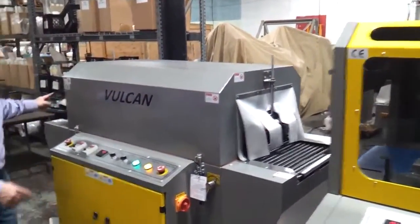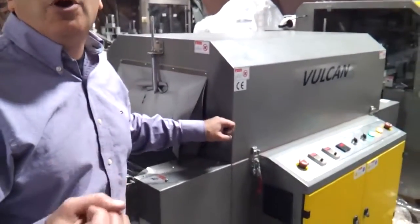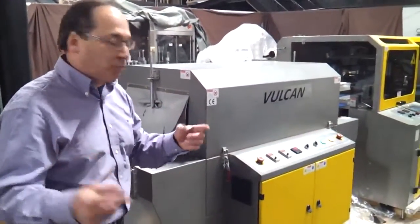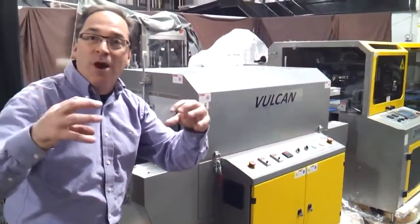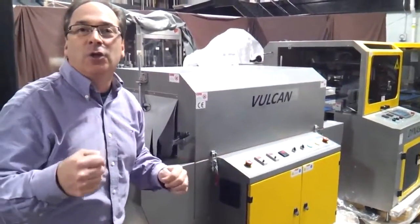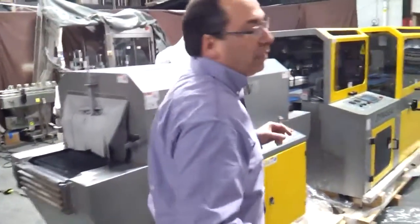On this side, we actually accommodated something also very new. We all know how the corners and dog ears on round products are very difficult to shrink. These 2 levers are actually controlling the direction of the airflow and where it hits on the package, targeting it like a heat gun onto the corners of the package to eliminate dog ears. Back over here, we'll hit start.